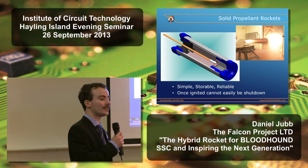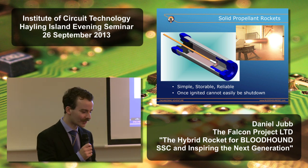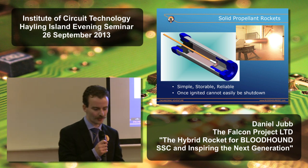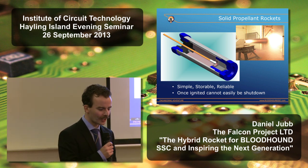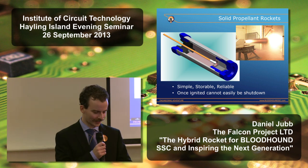Now, there are ways to do this. You can attach a flexible explosive charge around the nozzle, and if Andy needed to shut it down, he could fire that, and it would chop the nozzle off, immediately drop the chamber pressure, and the nozzle would go flying off down the desert. We suggested that to Andy, and he raised his eyebrow and said, I think you'll have to come up with something a little bit better than that.